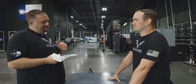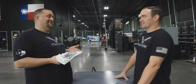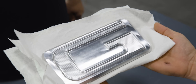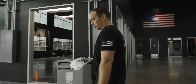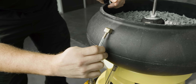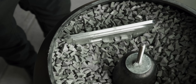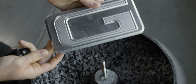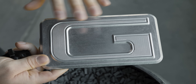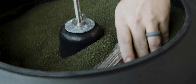I have these machined parts here — I got all the tool marks out of them, but I still have these brush marks. I wanted to see if you could throw them in the Burr King and tumble them with maybe ceramic first and then walnut shell, and make sure these come out even greater than they are right now. Basically we've got a pump pumping in a little water mixed with some soap, and we're going to throw our G in there first. It's just going to work its way around the tumbler and give it a really nice consistent surface finish along the whole part. We got our last letter here — still a little wet from the soap, but the ceramic media did its job. We got a nice consistent finish on all surfaces. Now we're going to pull our ceramic media out, replace it with walnut shell, and it's going to polish up this entire part and make it just perfect.